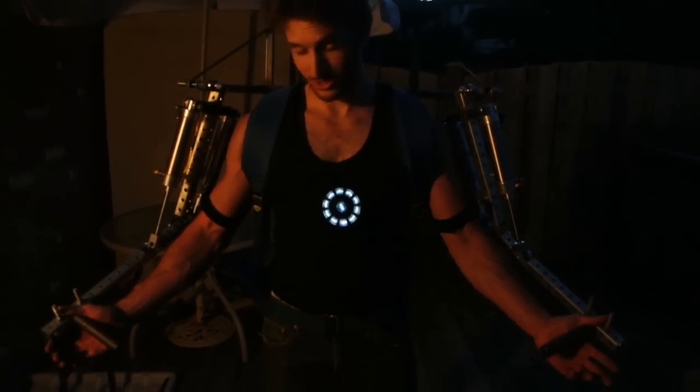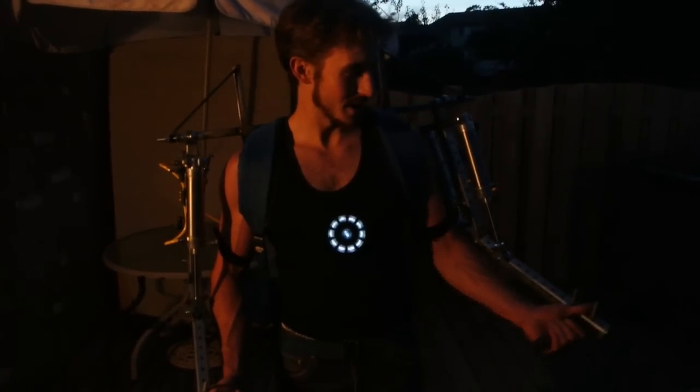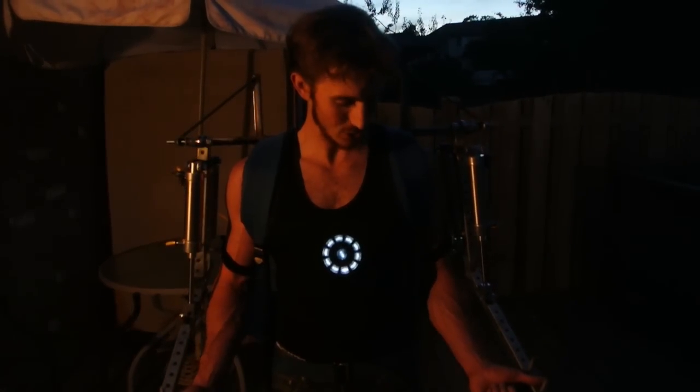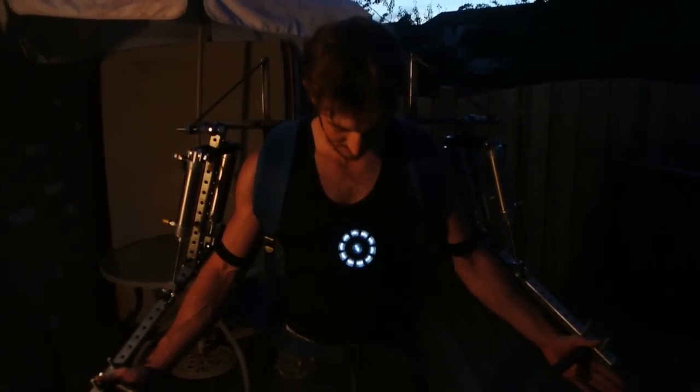Alright, so I'd say that was a success. It did not feel like I was lifting 170 pounds. I was helping a bit, but that's because my air compressor only does 125 psi. These cylinders are actually rated for 250 psi, which means if I upgrade my air compressor, I could potentially curl around 300 pounds. But I don't think my back or legs will take 300 pounds like that, so I'm going to have to build the lower half of this exoskeleton. So stay tuned, lots of updates coming.